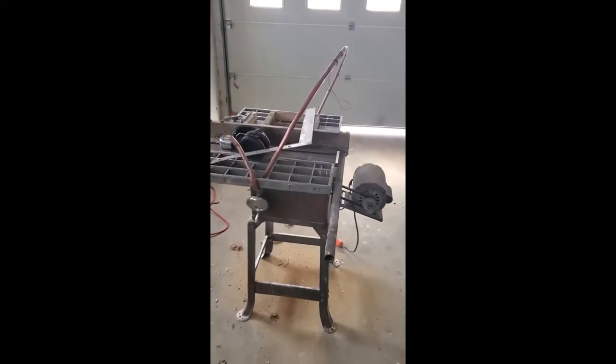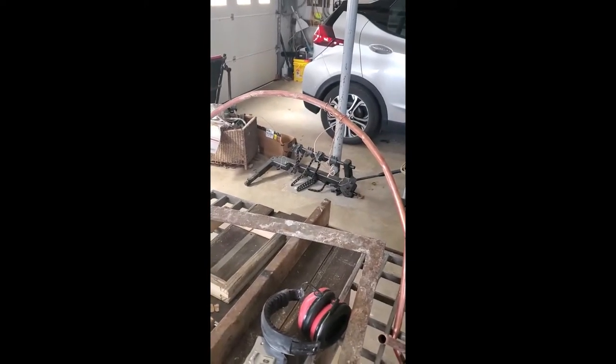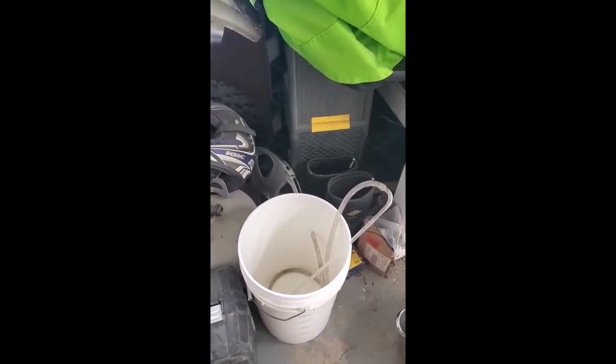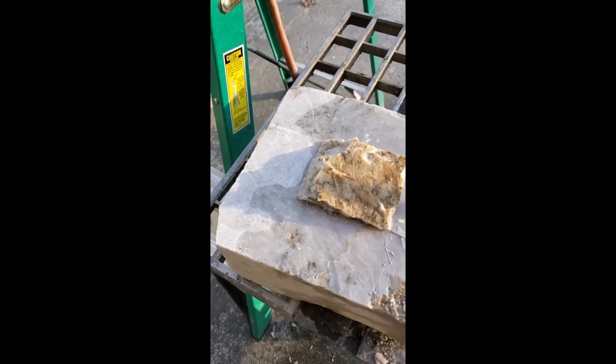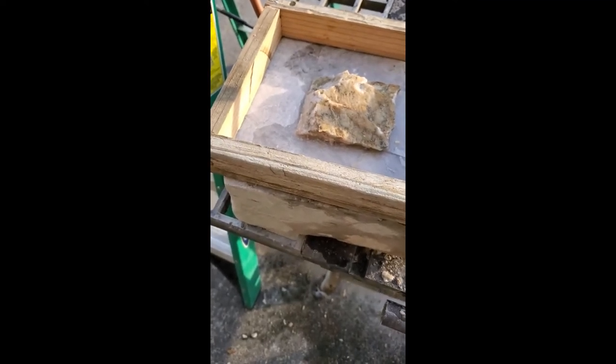I'm going to be using a diamond wet saw on my table saw. And this contraption made out of bent-up copper pipe is to hold a plastic tube - fill that with water, put it on a ladder, and start a siphon - so that I can have water for cutting the stone. I've gotten it mostly flat, not completely even, but I have this bit in the middle, so I've made a jig that it will sit on, then flip it over. I'm not sure if this is going to work because of the size of the blade.